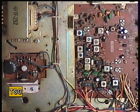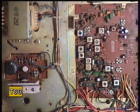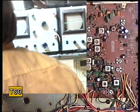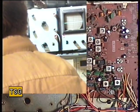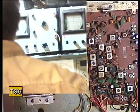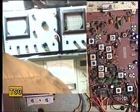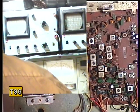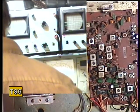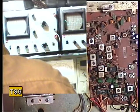We'll get the oscilloscope out for that. Got the proper Uniden mic for this. Switch the other camera on — it's the right-hand oscilloscope. Now I might have got issues with the mic socket, so I'll pause the video. Resuming — I've cleaned up the pins of the microphone socket using a fiberglass brush, so now getting the proper trace. The deviation we'll set for 2.5 maximum — which is there. We'll just do the whistle test and make sure. Yes it is — that's lovely.